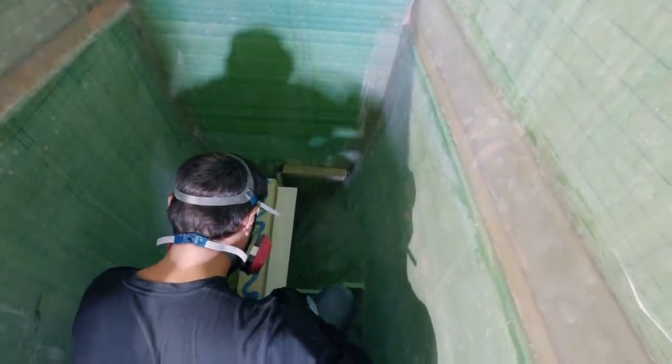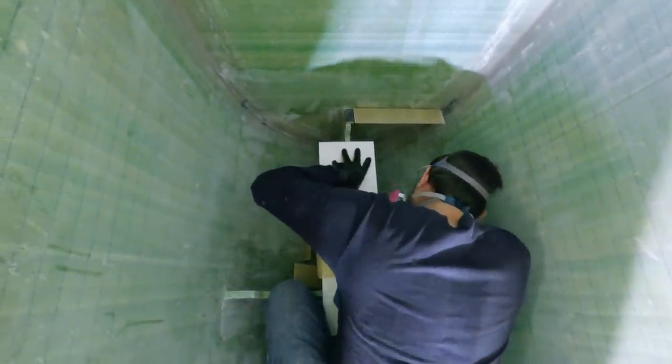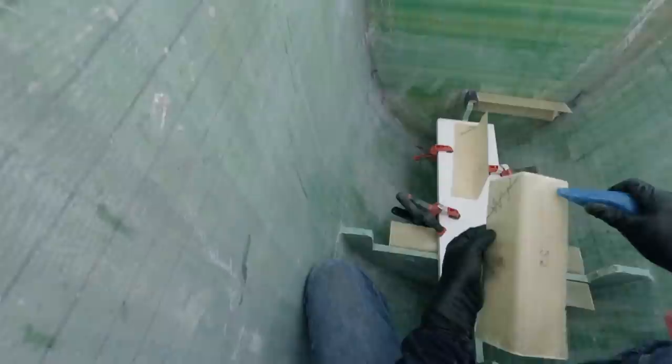To give our shower pan a good surface to bond onto, as Matt had mentioned, we're putting 90 degree flanges into the webbing of the hull to create more of a bonding surface. All of this is being done with a structural putty polyester resin from Total Boat.